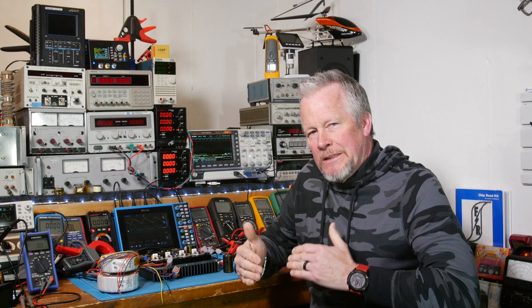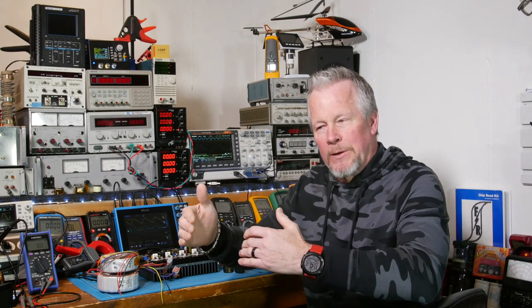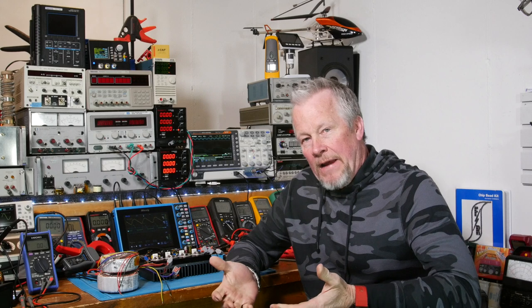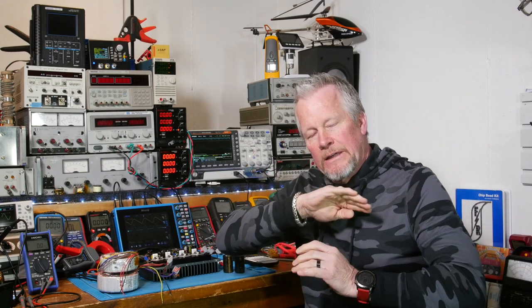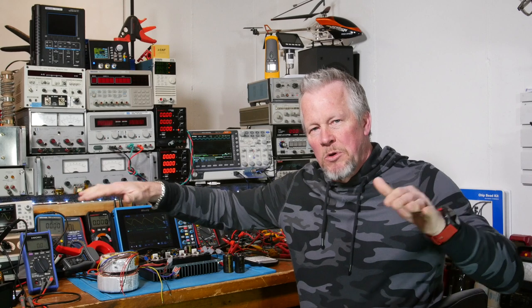Now I know some of you would say take two of those guys, put one in a monoblock. And what kind of filter — are you going to just use capacitors? Or is it going to be CRC: capacitor, resistor, capacitor? I know a lot of people like that. What size resistor? Half the capacitors, resistor, half the capacitors? The value of that resistor provides some impedance for the inrush, but the other caps still get a huge inrush. The advantage is you get an RC filter on the output — so as current is being pulled, you get ripple on one side of the RC filter, and then after the RC you get a slower RC time constant. Effectively, you're changing the 120 hertz ripple into something smoother.